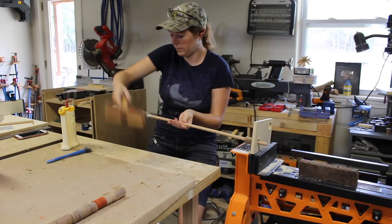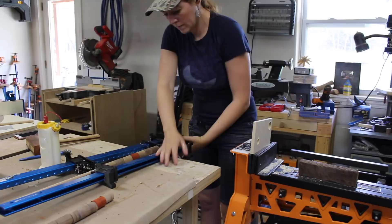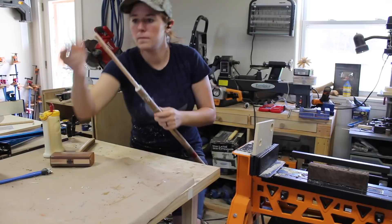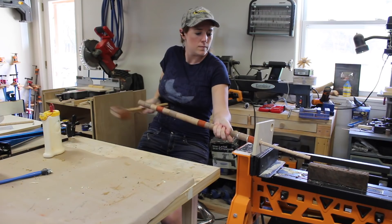On this go around, I drilled a hole in a scrap piece of wood — this hole is larger than the diameter of the dowel but smaller than the diameter of the segments — and stuck it in my super jaws so that I could very easily hammer these segments into place. After getting about a foot or so assembled, I would set them in clamps and let them dry. After letting it dry for about an hour, I repeated the process until the entire cane was assembled.